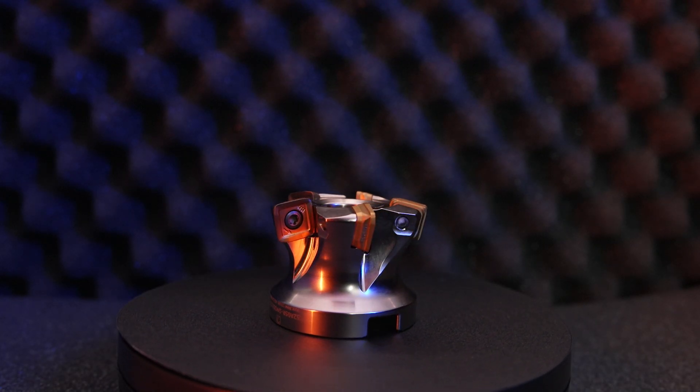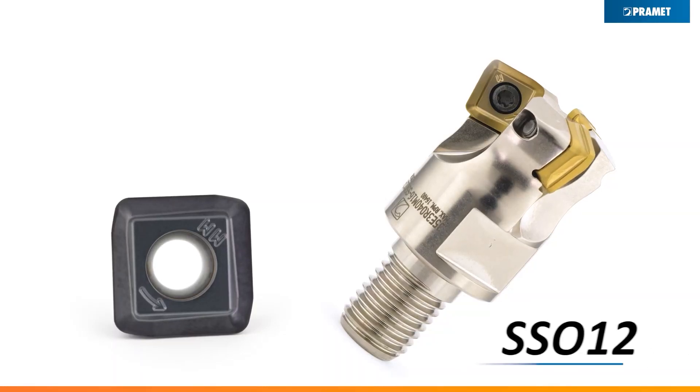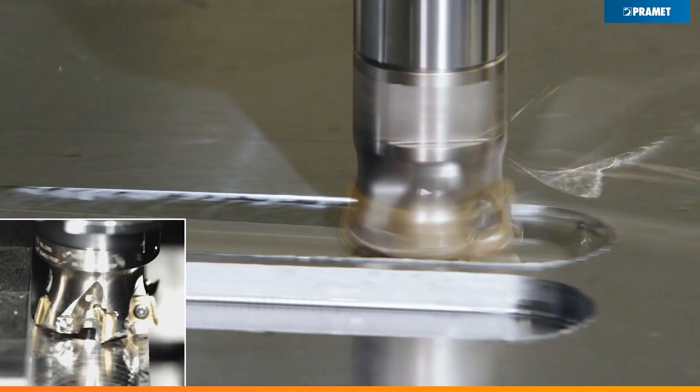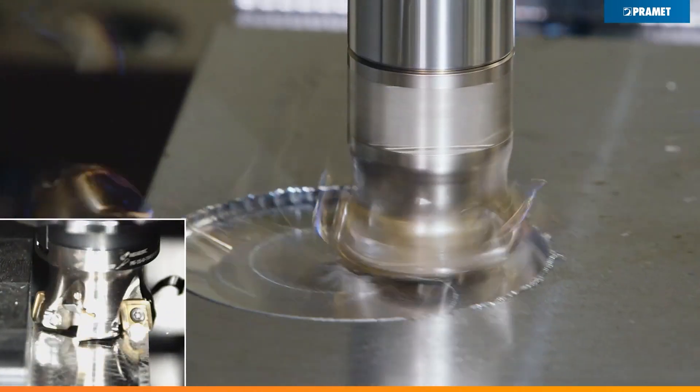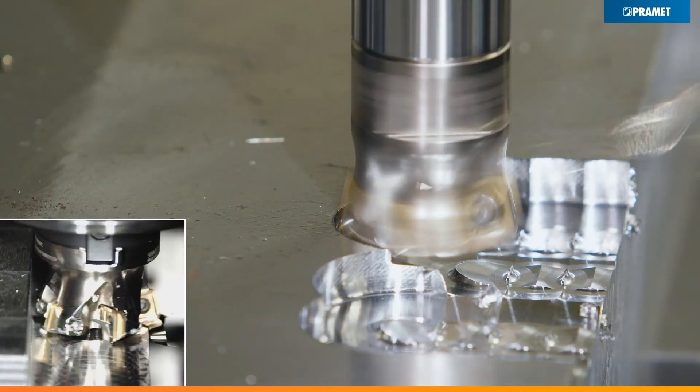What happens if we're in a job shop doing mild steels, P20s, and tool steels? At the minute in this tool we've got the MM chip breaker, which is more suited to stainless steel and super alloys. We also release this in an M geometry which has a little bit more edge protection for cutting your P20s, steels, and EN8s. We also have this available in CVD and PVD grades, so we've got grades and geometries available for all materials — good for production runs and job shops doing different materials day in, day out.